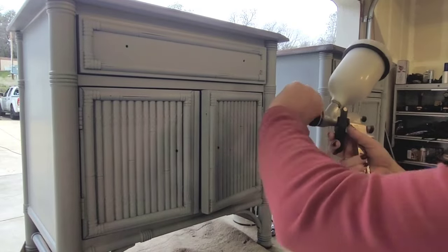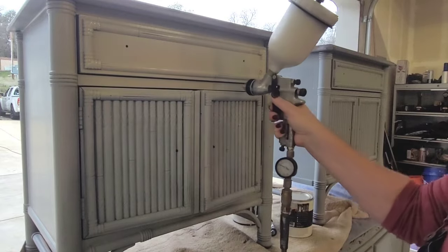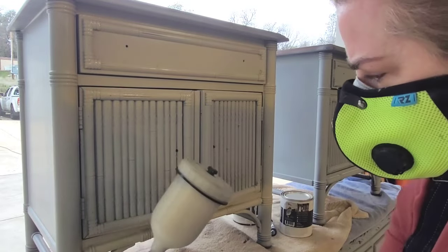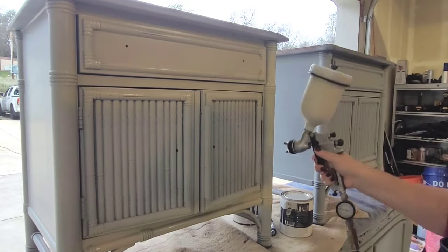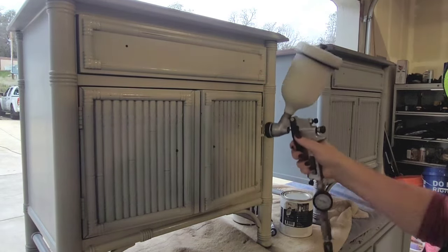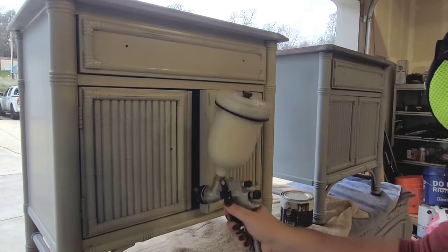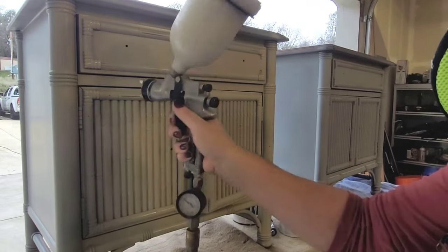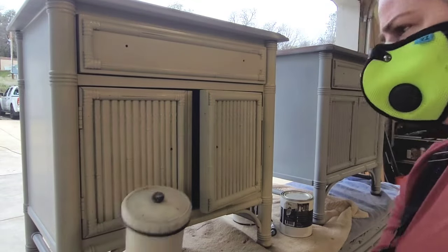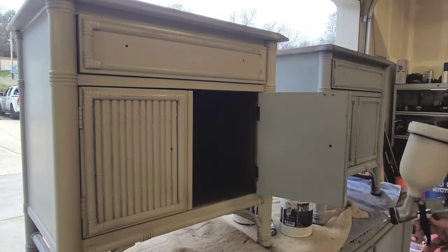Next up it's time for the nightstands. All of this took two coats — two coats of primer and now two coats of the One Hour Enamel in Safari Jacket. I also chose this color because it's a nice neutral that can fit in with a variety of home decor styles. This is a bedroom set, so it needs to be universal and go through many decor styles — you could change the bedding and this paint color is still going to work with just about anything. With spraying, you exchange the time you'd spend brushing for cleaning and setting up your sprayer, so overall the time about matches what I'd spend brushing on a coat.